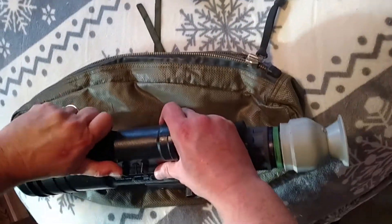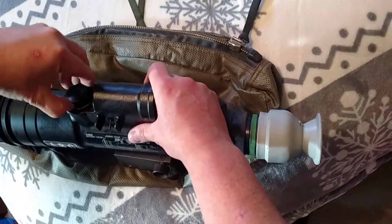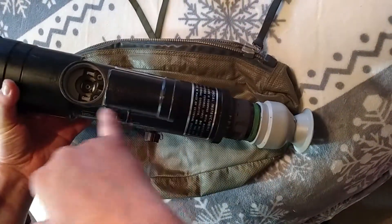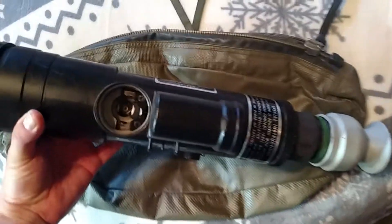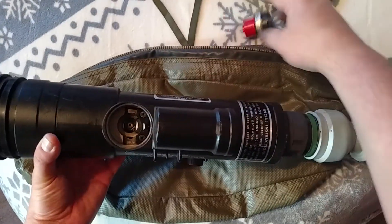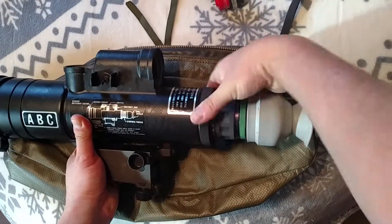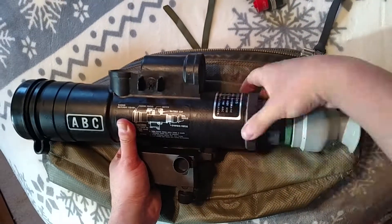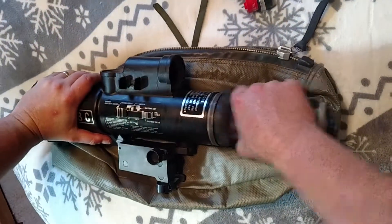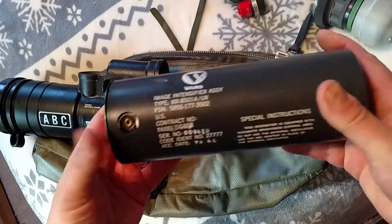With the battery out, in order to get this tube out you have to remove a couple of pieces inside. I have no idea what these things are called, but this little piece sends power down to the image intensifier. That little brass circular thing you can see in there is part of the image intensifier. Once those are out, you remove the eyepiece assembly by just removing this ring here — once removed, it just pops right out. You might have to nudge it a little; sometimes these are sealed pretty well. Just grab the unit and pull straight out. The whole tube ends up coming out, which is no big deal.